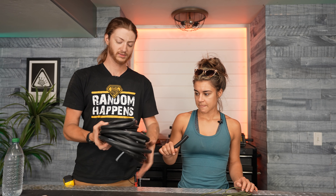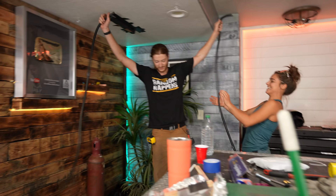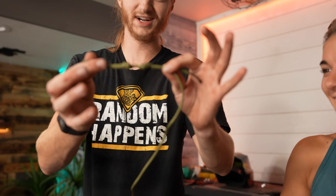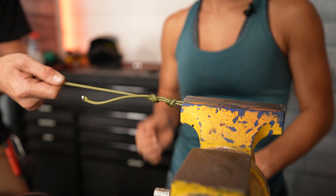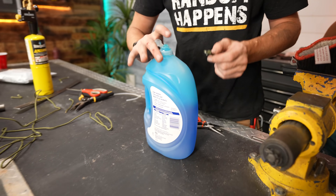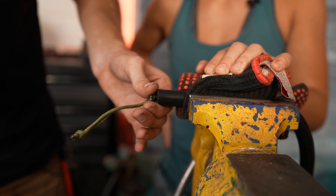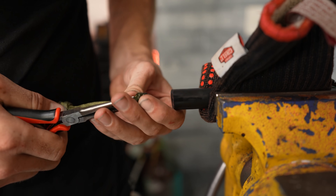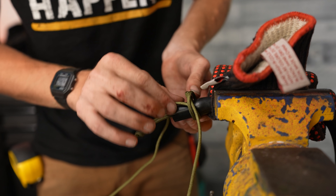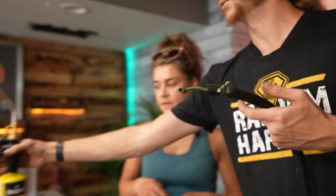We have a huge amount of spear gun rubber — probably around a hundred feet — and this stuff just has a life of its own. We need to make sure it's roughly straight with no kinks, then attach the two ends together with some paracord. We stick the knot in a vice and make it as tight as humanly possible so it's very small. A trick from ZNA Productions: take a little bit of soap, cover the end of the knot, and use needle nose pliers to carefully slide it into the tiny hole in the rubber tubing. Then pull really tight and rotate it down — it cinches down super tight. Snip the ends off, carefully burn them without burning the rubber.